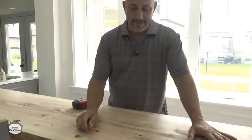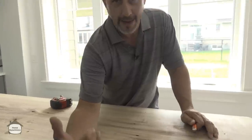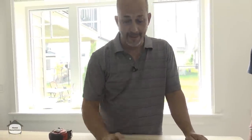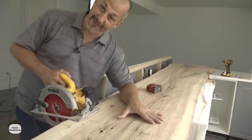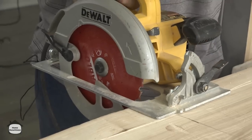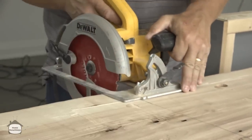We're going to cut the slab before we flip it over, because we're using a skill saw which cuts from underneath. If we cut this way, we're cutting through the finished side of the counter — that'll keep it from having any splinters, splits, or tears. If we install it first and then cut it, we run the risk of tearing up the top of our counter just before we're trying to finish it. I'm going to cut from the side that's not falling off so that the saw doesn't risk binding. Somebody needs to hold the weight but not let it twist towards me.